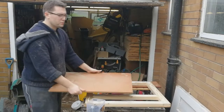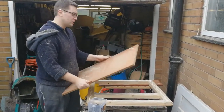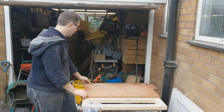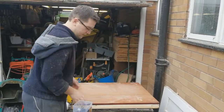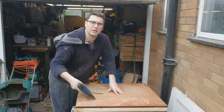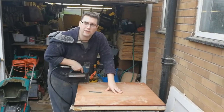I need to make two of those and cut another one to fill in that extra gap. I've put some glue on the base of the frame and cut my two pieces of chipboard to size. I've put them on top of the glue with the other small piece next to it and that is the perfect size. Now I'm going to use my air compressed nailer to put nails all the way around the edge.